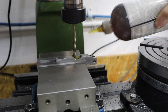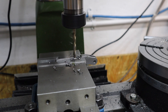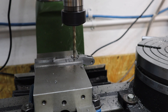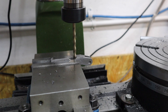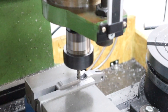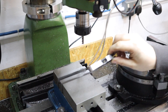With that section now flat enough we can come in with a 6mm drill bit and drill this out in a series of passes. One of you guys left a comment suggesting using a drill bit to take out the majority of the metal first, and ever since that comment that's what I do - you guys were right, it speeds up the process a hell of a lot. I'm aiming for a quarter inch slotted hole here, so starting with 6mm to remove most of the material, then coming back in with a quarter inch end mill, plunging down and taking progressively deeper cuts. With that all done, the slotted hole is finished.